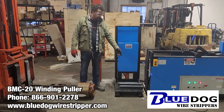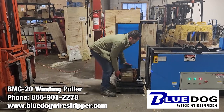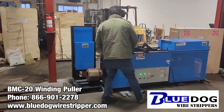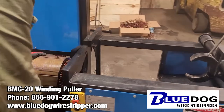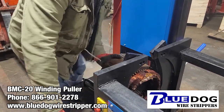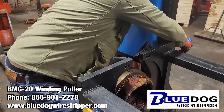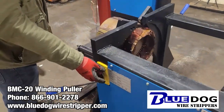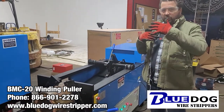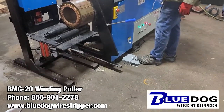What you want to do is lift the scrap stator onto the elevator. This is heavy, but I think I can handle it by hand. This is the elevator — you adjust it to the correct height in order to get the grip claw to pull out the copper windings. You want to pull back the curtain protectors, then push the stator in until the curtain guards are flush. Adjust it into place — now everything's secure. This has a grip claw on the front and you need to adjust it closer to the stator in order to pull out the windings. There's a foot pedal here: this side makes it go towards the scrap stator, and this side retracts it.